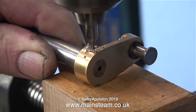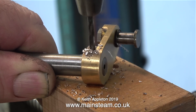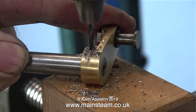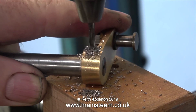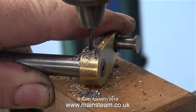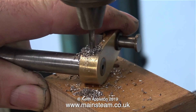From an engineering point of view, I should use a V-block to support the crankshaft so that the hole in the crank web remains at 90 degrees. But I didn't do that, mainly because there was a massive bang on the roof of the shed — there's a really bad storm out there and part of the roof blew off. But I continued drilling the hole in the crank web, and here the drill bit is about halfway through the steel part. The plan is to drill a one-eighth-of-an-inch diameter hole through the centre of the crank web and the crankshaft, then use a taper reamer followed by fitting a taper pin into the hole, and this method is usually perfectly satisfactory.